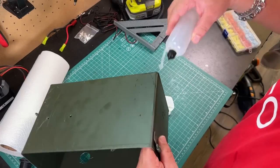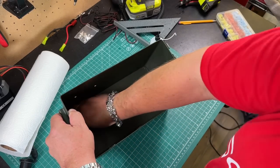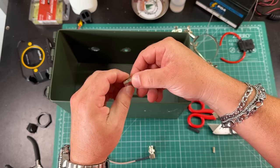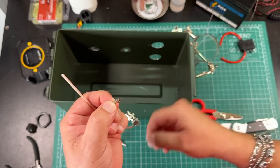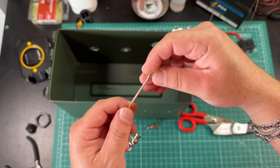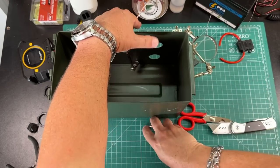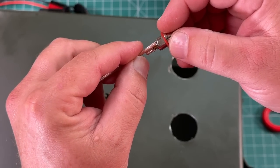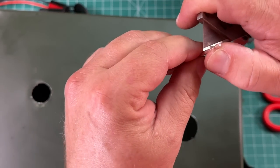Next, I'm using some rubbing alcohol and some paper towels to just clean off all the surfaces — get rid of all that gun oil, clean the inside and the outside nice and thorough. Next, we're going to install our coax and our antenna connection. We need to be careful because this antenna connection actually has a nut and a washer that we need to put on the cable before it goes through. We also need to take this ferrule that will crimp to the end of it — slide that on. Before that, I'm actually going to put some glue-lined heat shrink as well for a little bit of strain relief. So we've got to have all that stuff on before the coax goes through this hole. This BNC connector has a little window where we can insert our soldering iron and solder the center conductor. We just need to cut a little bit off to get down to the center conductor, and then cut some more of the jacket to get to the braid. A nice sharp razor blade makes that pretty easy.